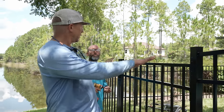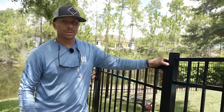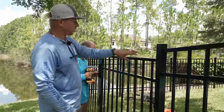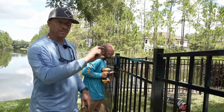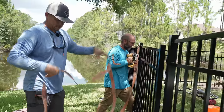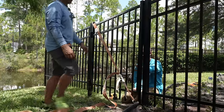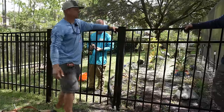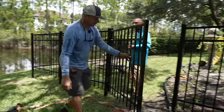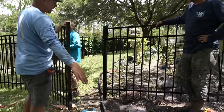I don't know many people that think this looks amazing. What we're going to do is rack this gate, even though it's already solid welded aluminum. Just so you're aware, we've got about three inches here — that's probably pretty close to the maximum I want to try, because if you try to rack these much more than that you could risk breaking welds, bending pickets, and you'll get an arch in the top rail. We have a little bit of forgiveness but not a ton. So this looks pretty good right here, but we've got to go past because it'll spring back. And boom — just like that, we have our racked gate. Now you can see clearly why we hang off the low post, because it starts off closer here and as we open it gets further away since the ground slopes this way — had we hinged it on the other side we could risk hitting the ground trying to swing it.